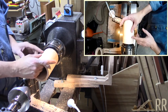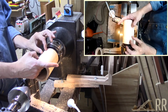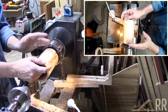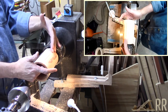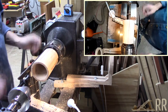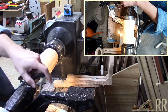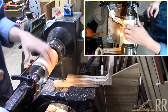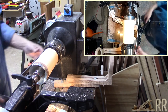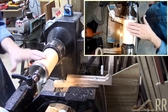So I've marked the depth of where the bottom is going to be cut off. The actual bottom is about here, but I want to leave a nice thick bottom to keep the weight and center of gravity fairly low. Probably just give it a very slight taper in, mostly just cleaning up to get rid of this bit of bark that's left over. So let me pull the tailstock up with a cone center, add a little bit of pressure — not much. It's in the chuck but at least that will keep it from vibrating.